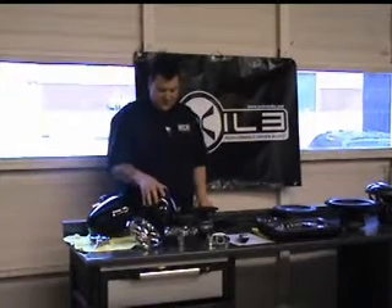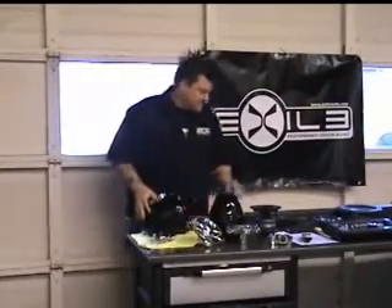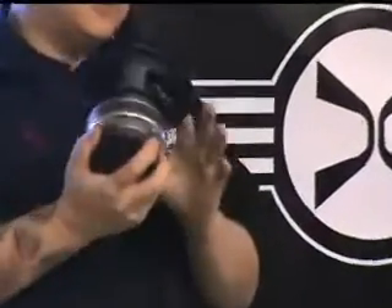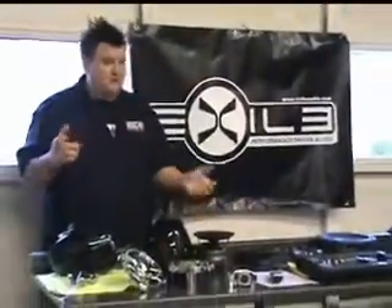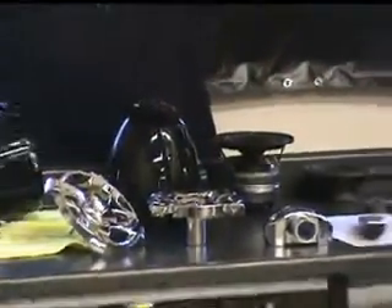Now on to tower speakers. The horn compression driver — this is your standard kind of six-inch driver with no tweeter. The horn actually has a diaphragm with a secondary magnet in the back that plays the upper frequency levels. Horn drivers are very common in concert applications — those big square boxes with the large flanges. The reason horns work so well for concert speakers is they project sound far away. You can get a horn to sound phenomenal, but they're a very tricky driver to make sound good.